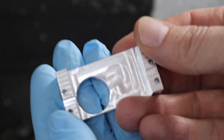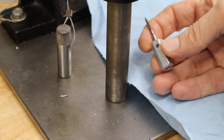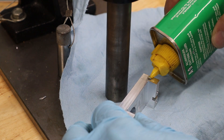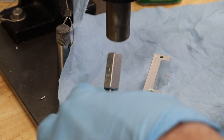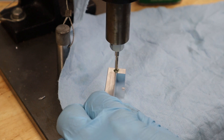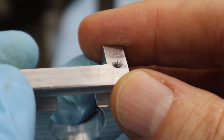As you can see, it looks good. I have this 4-40 tap in a holder, and this allows me to tap it straight up and down so it's aligned correctly. I want to put some paper towel underneath here so I don't mess up the nice finished part. I'll put some tap magic in here and get started. Those holes looked very nicely tapped.